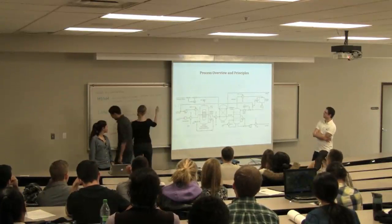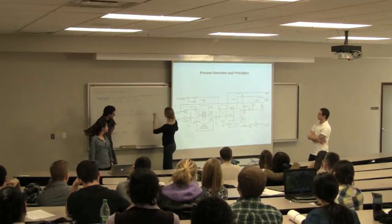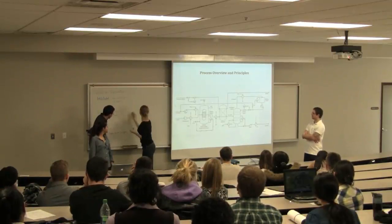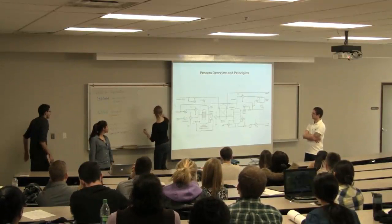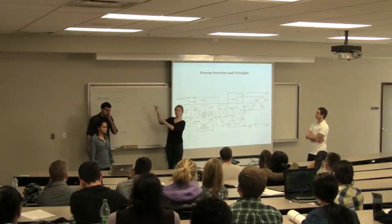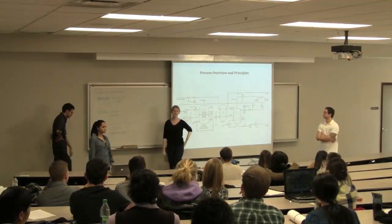Obviously it's going to be a packed bed reactor, so we'll have it horizontal and we'll have our feed going in and our product coming out. The way they had it on the flow sheets we saw, I'll just draw it here. It was kind of bigger at the top and smaller at the bottom. And it had a level where the water was fully around the reactor. They had level sensors on it to make sure that it would stay fully submerged.